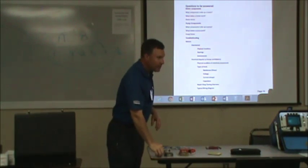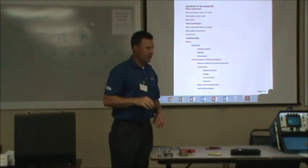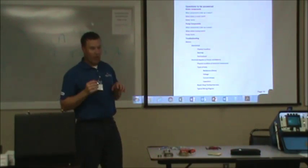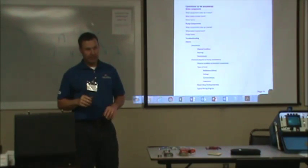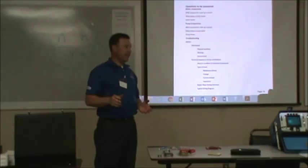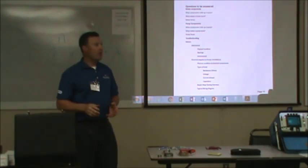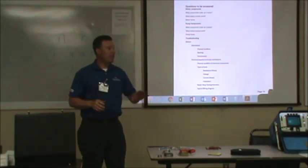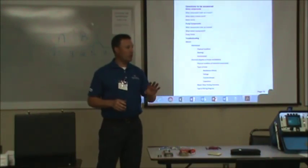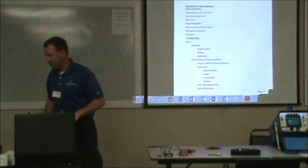What type of grease do you recommend? Anything with a polyurea base. We use Polyrex EM, which is a Mobil product. A lot of people grab up anything in the world. Some greases are conductive. What was the name of that again? It's Mobil Polyrex EM, but anything with a polyurea base. And I'd have to get a dictionary to spell it.